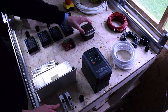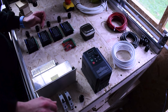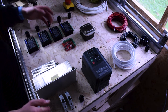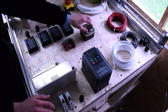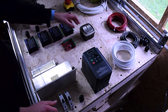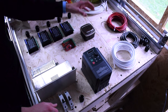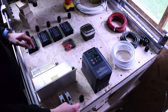The reason for separate circuits is safety, and the switch is just for convenience. For example, during calibration or testing I might want to run the machine using Mach 3 and move the steppers without the spindle being on. I can keep the spindle off and switch everything else on, or boot the electronics up first and then switch the spindle on. It can also act as another way to terminate the spindle in an emergency, although your main call is always the emergency stop.